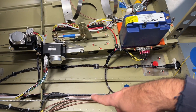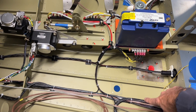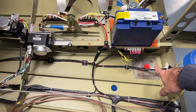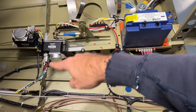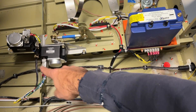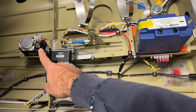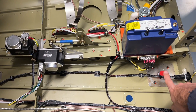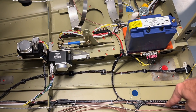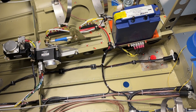Here's what we're thinking for the wiring. I measured: if I split the CAN bus here to go that way, I'm adding about two feet of CAN bus with the service loop — plus a bunch of rewire, because I have to pull this back and cut into all of this. It's a lot of work. But if we go this way instead, to the end of the bus which is at the yaw servo, it's about three feet. For just one foot of extra CAN bus length, we're saving ourselves a ton of rework and a ton of cramped access work in there.